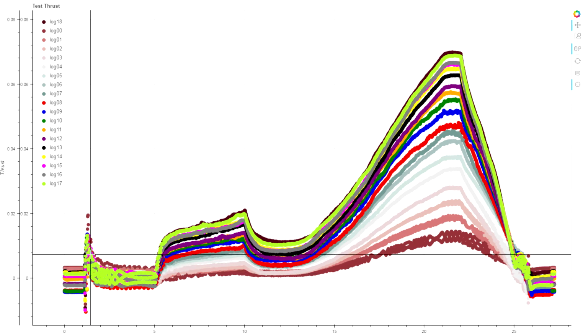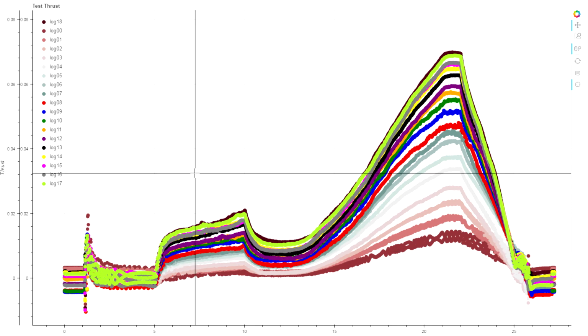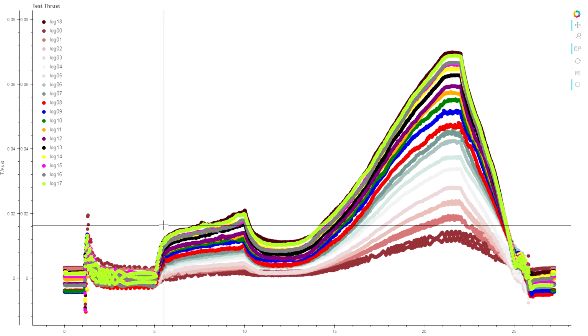I've tried it with additional preload, with like a rigid screw preload, and with a hanging weight preload. I ran into a bunch of problems with, I was using silicon pads as isolation, and the silicon seeming to creep under load, where when you have it under load for a short period of time, it doesn't want to release all the way when you've got a preload pushing down on it as well, and that causing additional, even bigger offsets than this.